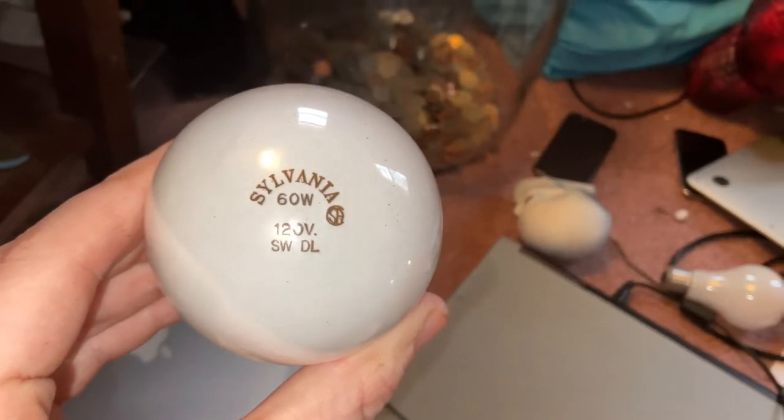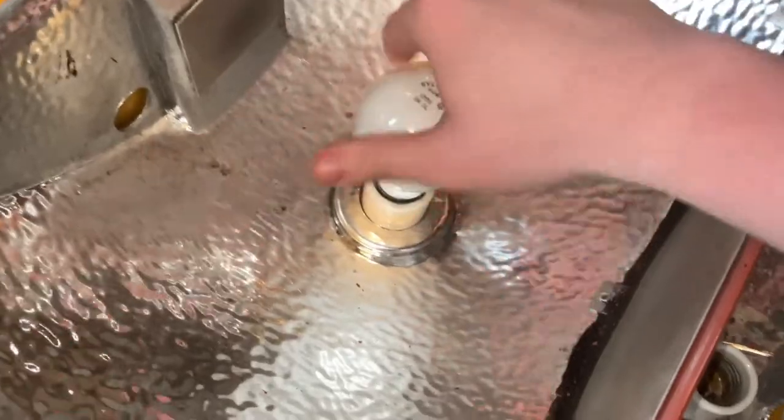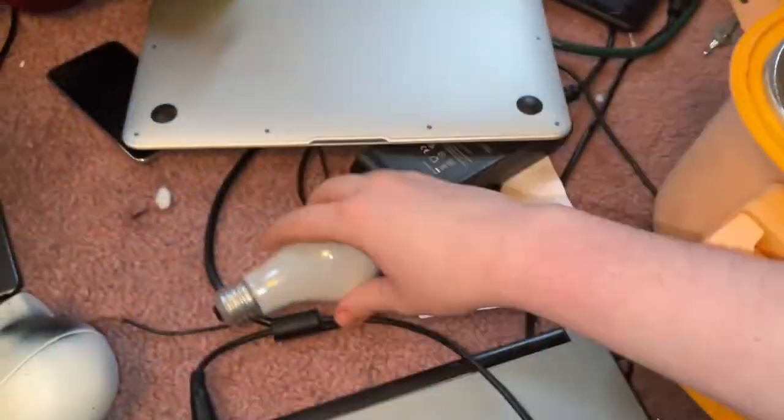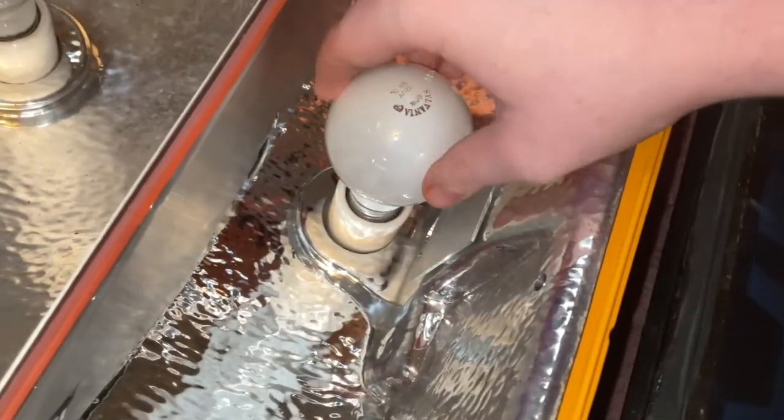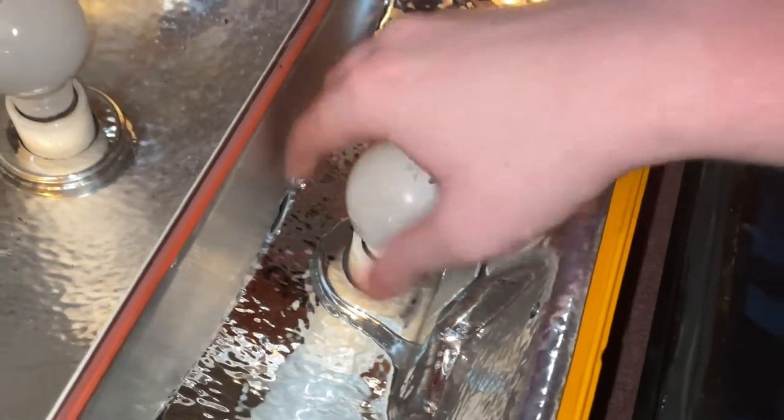Make sure you know these pedestrian signals are 120 volts. You've got to get your light bulb — I'm using a 120-volt light bulb. You know how a light bulb works: you just connect it through here. Once that's connected, get your other bulb and do the same thing. Once your light bulb is in, before you close up the signal, make sure you just plug the signal in and see if everything works just fine. I'm going to go plug in the signal. I almost forgot to tell you that on the controller, you can actually change the amount of flashes. Let me just connect the controller real quick.